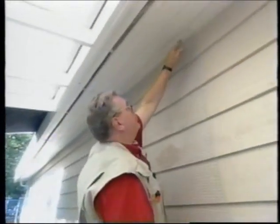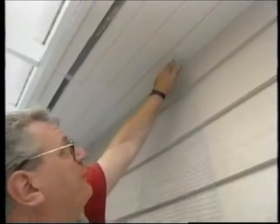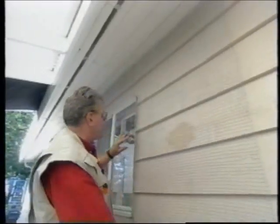There we have it. We've installed four hooks in the soffit, four inches out from the wall, so the screen mesh hangs on the S-hooks four inches out from the wall. That way it's going to discourage the woodpecker from coming to the area where the grubs were, and also stop birds from seeing their reflection in the glass. It won't take long for the birds to get the message. It doesn't spoil the view, but you'll save your home.